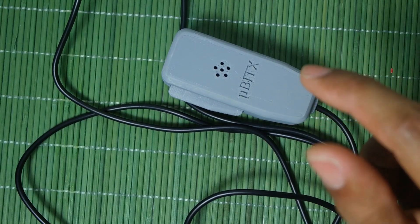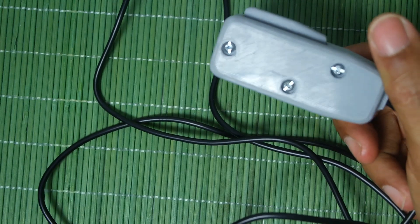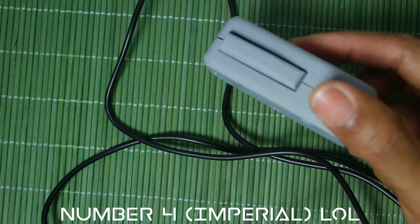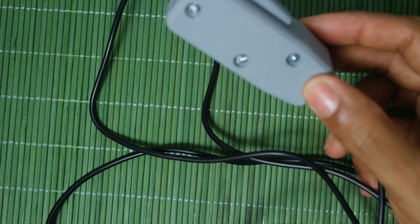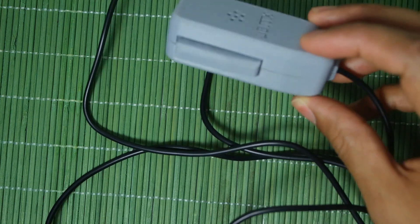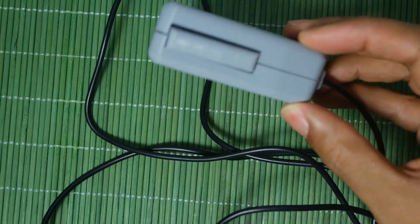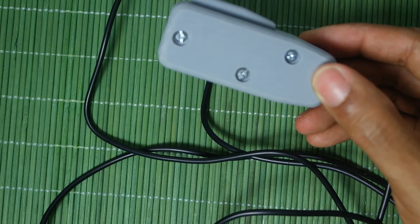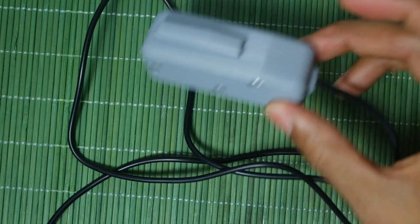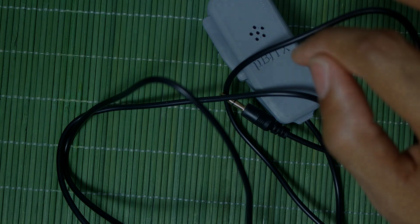Other than that, you just need five screws. These are 4-40 screws — something like that. They fit super well. If not, you can find M3 screws, and they have to be about 8 to 10mm long. It doesn't really matter as long as they are not longer than the case itself, it should be fine. Other than that, I don't have anything to say. Thank you guys so much for watching. This is Angel, and 73.